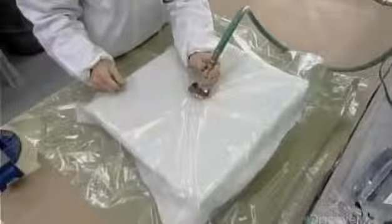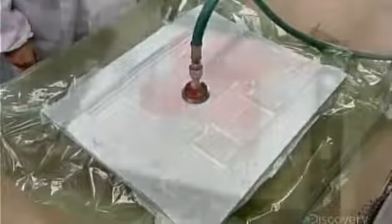that comes next. They wrap the mold in felt to protect the surface, put it in a plastic bag, attach a hose, then start the suction. Over 4 hours, the vacuum slowly extracts the air, drawing the fiberglass tightly against the foam core without any wrinkles or puckers. It takes another 4 hours for the resin to completely cure.